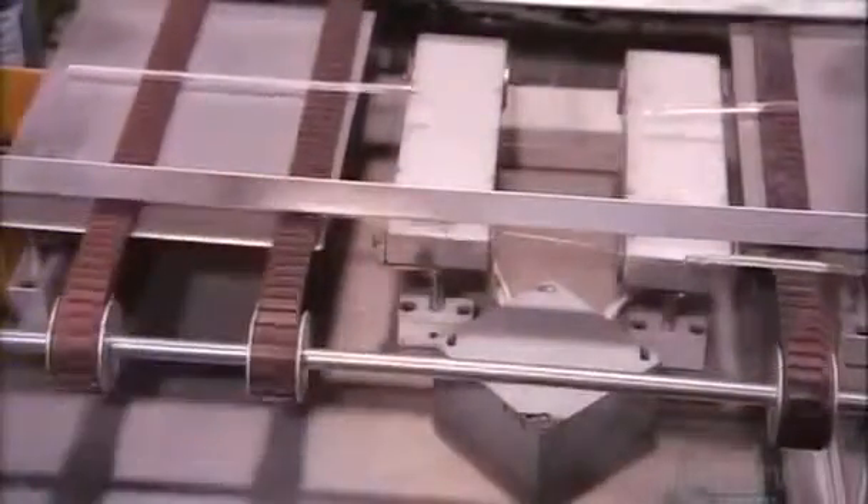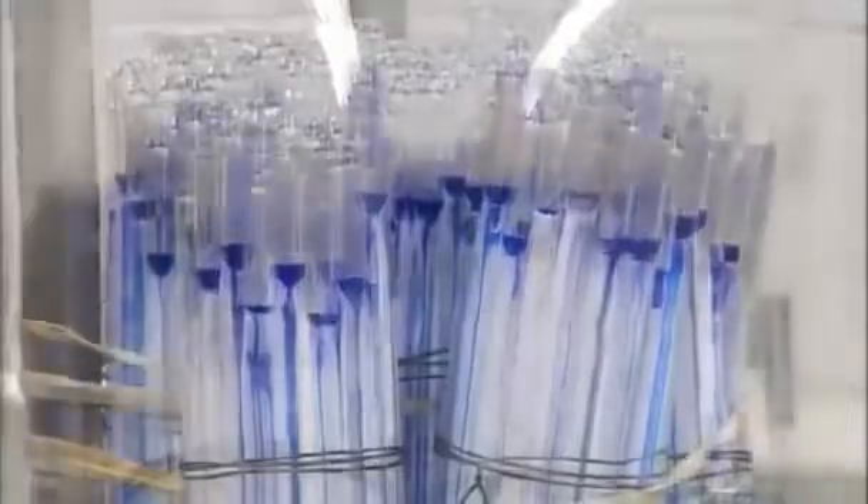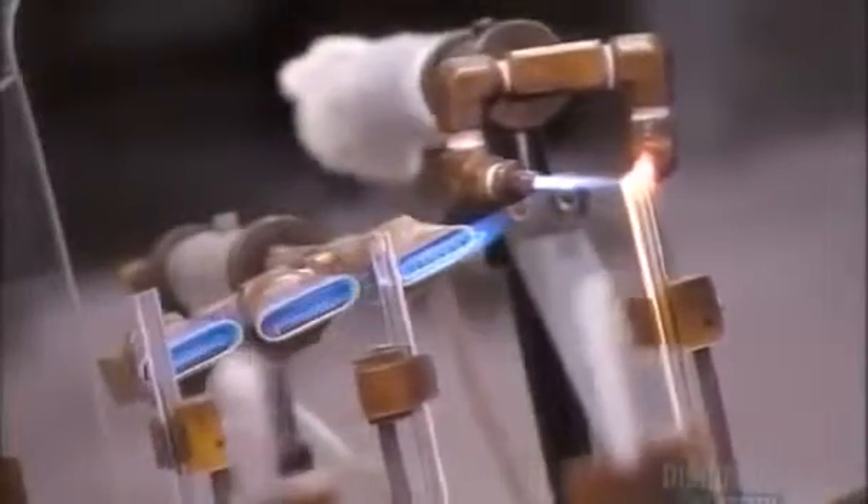They cool the welded glass and wire on a conveyor. Next, they turn on a vacuum pump for several hours to pull the air out of the wire and tubing. This draws the blue liquid wax up — this time it's not a test. The wax is a non-toxic alternative to mercury that will expand and contract with changing temperature. The thermometers travel through chilled alcohol, shrinking the blue liquid down to the closed end. As the tubing turns, flames follow the top end to melt and close it. A heat gun below then drives the liquid up the tubing, and the air pressure creates a bubble in the end that was just closed. This bubble will be the thermometer's expansion chamber.